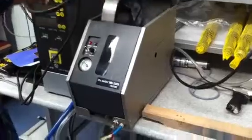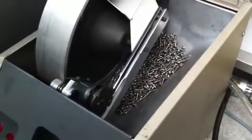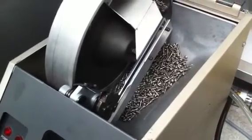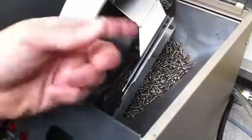Now within the insides of this system, you can see the rotary bowl, which is similar to a horizontal-type bowl, where it allows the vibration of the screw to come down to the track. The track gets presented to the blow-feed tube, and the blow-feed tube comes down and blows the screw in.